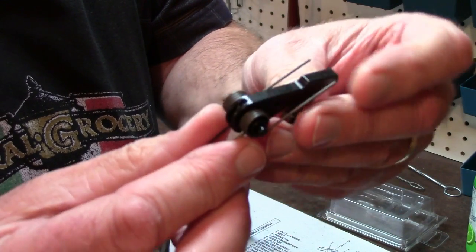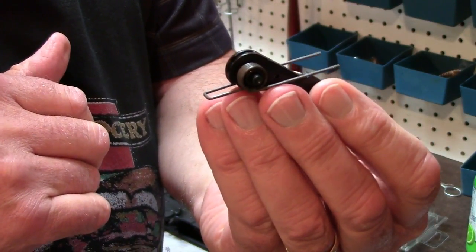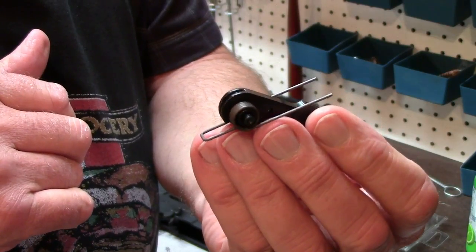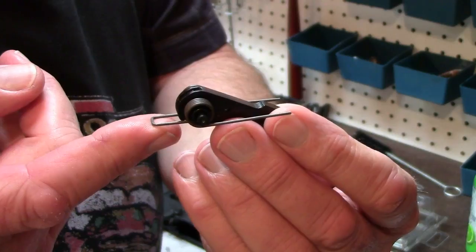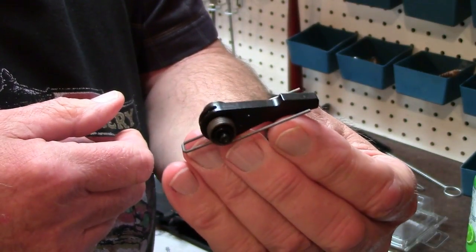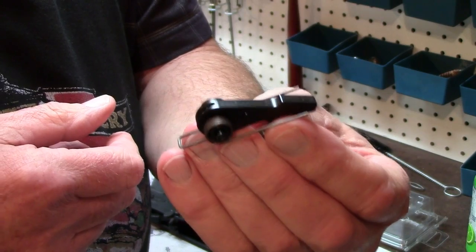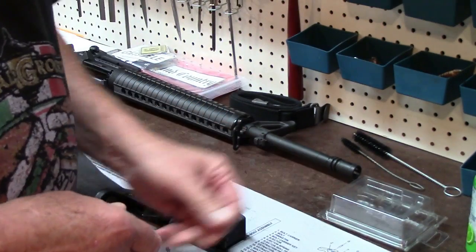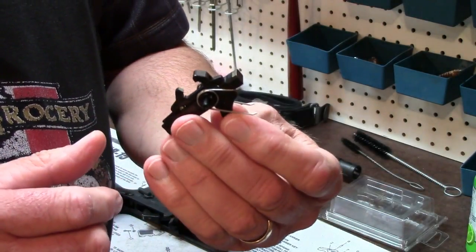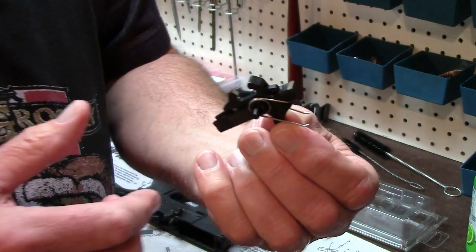So here we go. This is the hammer, and if you notice, it's got the main spring on the hammer. It has not been in any way contorted and relaxed. In other words, it hasn't been torqued to remove any stress. And I concur completely with what Mr. Geissele says: this is a full impact hammer, and reducing the impact of the hammer has been found in testing to greatly increase group sizes at 300 yards, because ignition consistency is very vital to accuracy. The manufacturers of primers have established a certain protocol for the amount of force that's required upon the primer in order to detonate them properly. So you don't want to compromise that by having a light hammerfall.